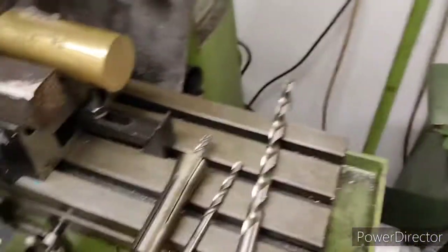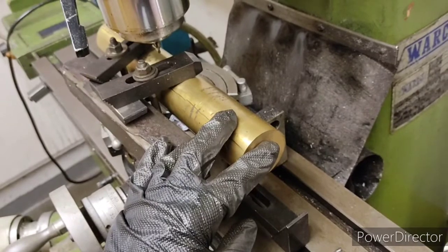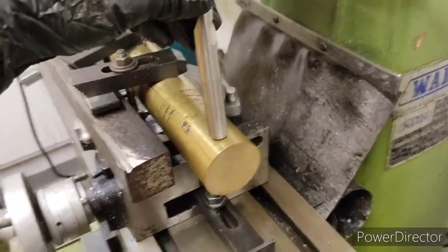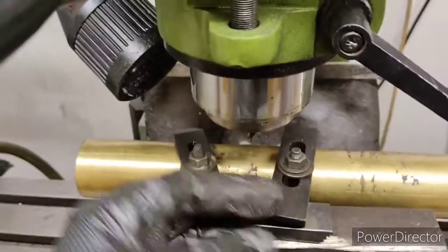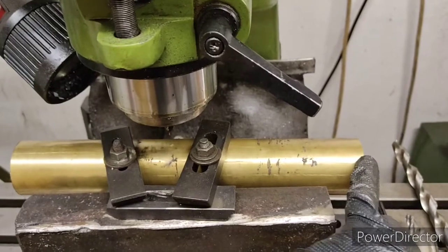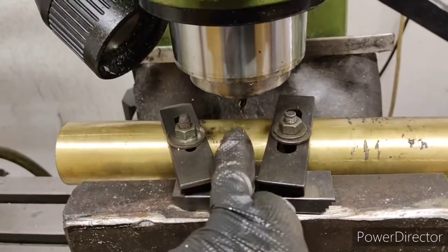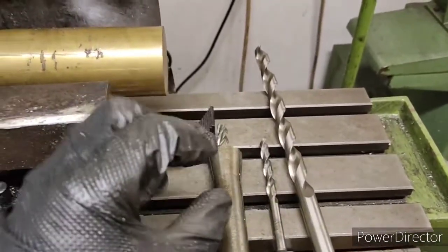What I'm doing now is machining some trunnion mounts — machining into the brass bar about 7mm to take a pin, going nowhere near the bore. I've centred the bar and I want the hole to be 163mm in from the end of the muzzle. So that's centred. I've got a centre drill now, I'm just going to bore it in and take the 8mm drill bit to go down about 6mm.